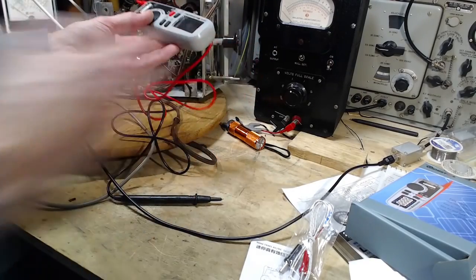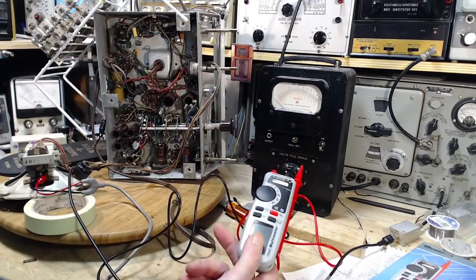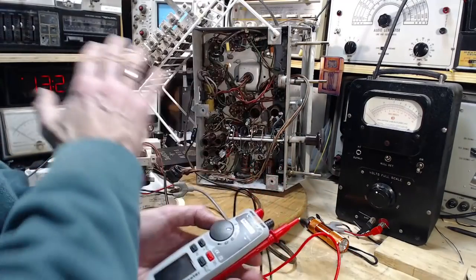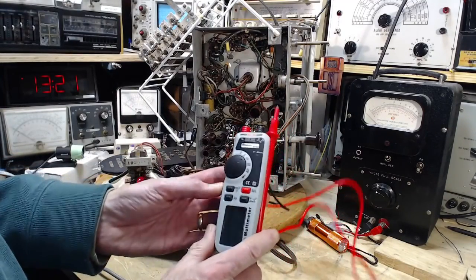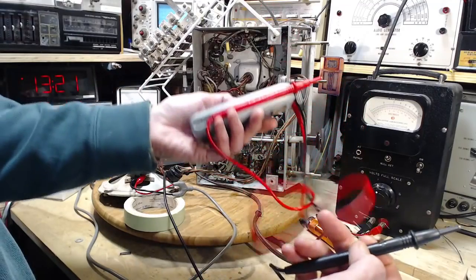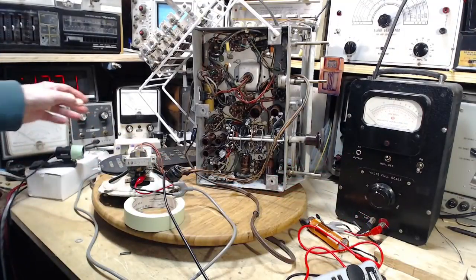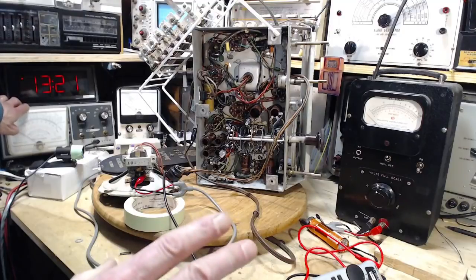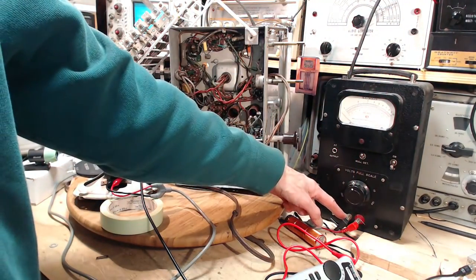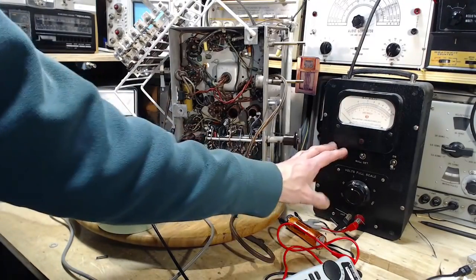It's very awkward in a shop like this to use an instrument of this sort — it's much better to have leads in your hands while the meter sits in one spot. But one of the key benefits of a battery-powered meter like this is there's no question: it is not grounded, it's not plugged into the wall. So it has no grounding issues and you can test anywhere in the circuit without worry. If you're using a meter that is grounded back to the power system, you have to be very careful working in a radio with that.